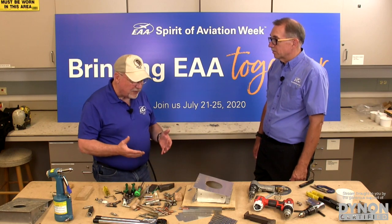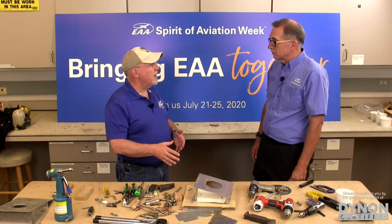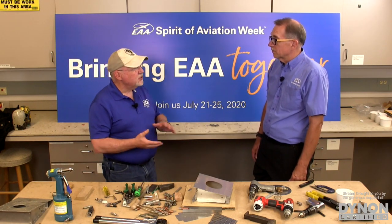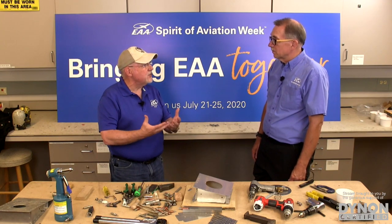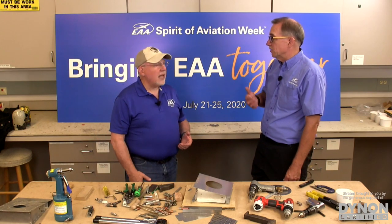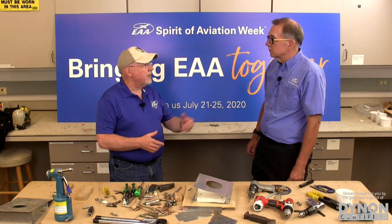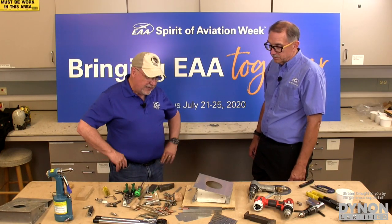So a lot of the people, even building here in Wisconsin, will do some kind of corrosion protection on the aluminum aircraft. There are several different coatings you can buy, very simple to put on, very light coats that give you that layer of protection so the atmospheric conditions can't get in there and start any kind of corrosion. You can buy them in spray cans, or if you're going to do all the wing skins, you get a spray gun. It doesn't hurt, and it doesn't add a lot of weight.